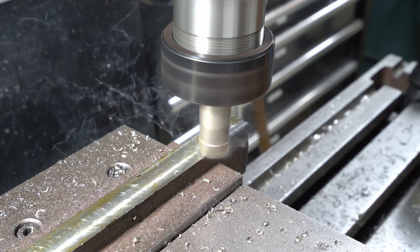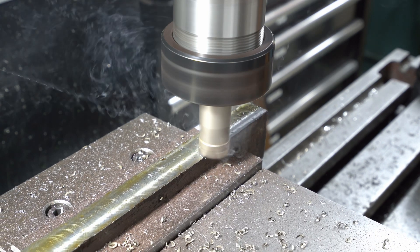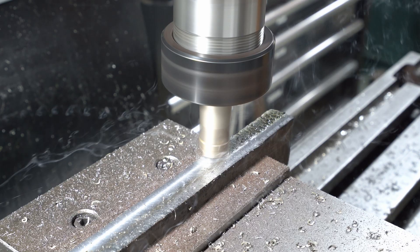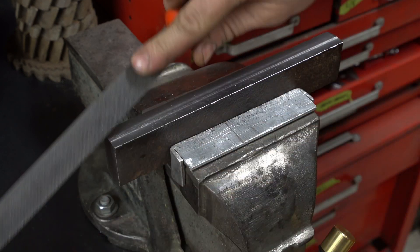When it comes to a finished cut, I'm speeding up the spindle, slowing down the feed, and I'm using a thick cutting oil to try and get as reasonable a surface as possible from this mild steel. Deburring in between cuts, just to minimise any chance of the workpiece cockling over in the vise.